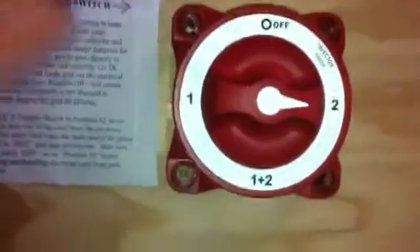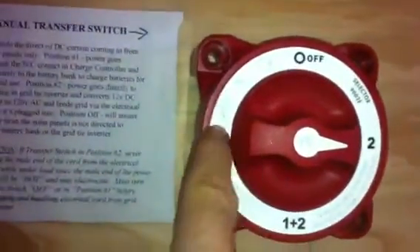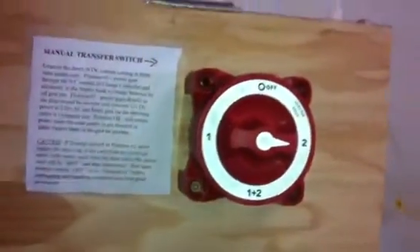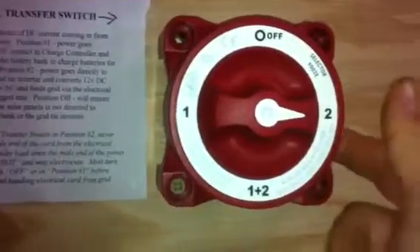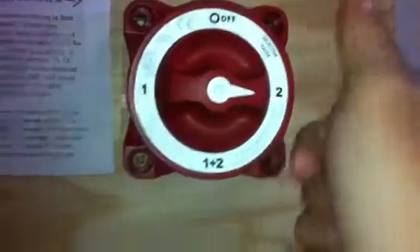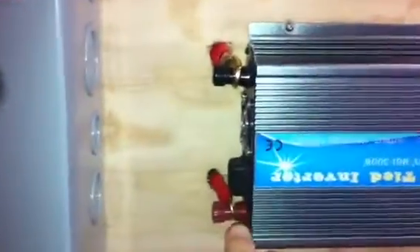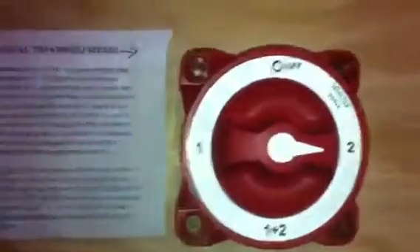There's a position one lead and a position two. Position one goes from this transfer switch to the battery and therefore charges the battery. Or, I have a lead behind here for position two — it goes from position two to the grid tie inverter to my positive here. Right now, we're in position two.